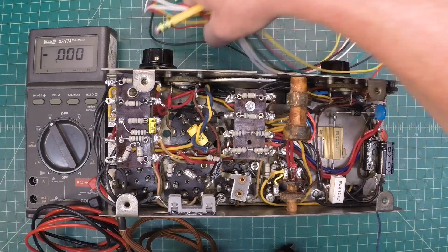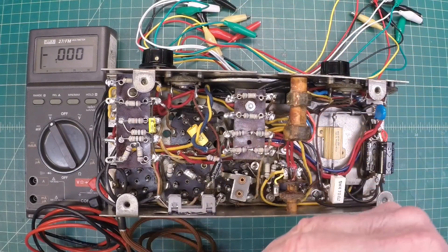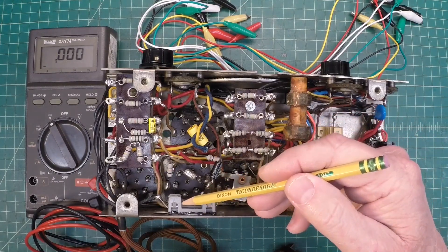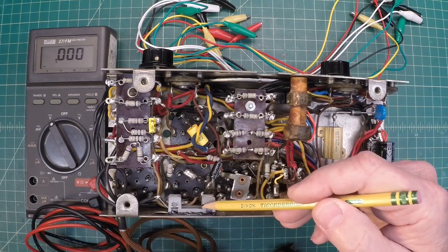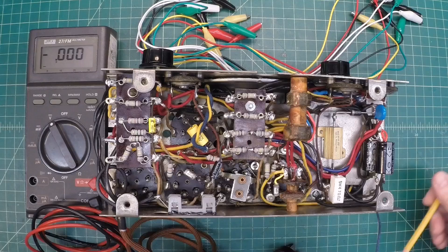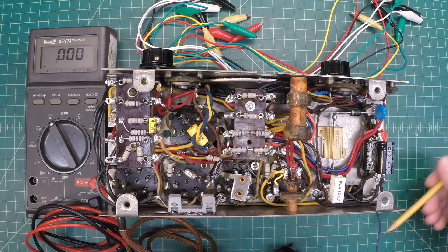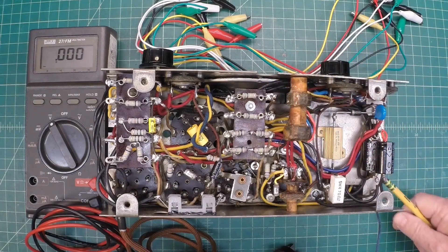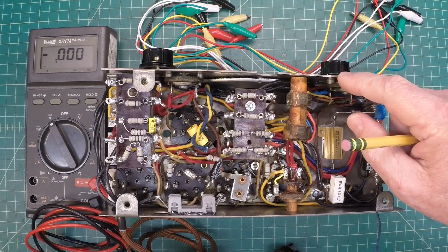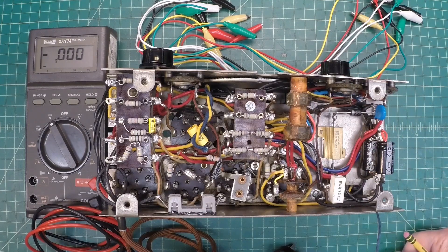You'll see I've got some jumpers laid out here. I'll get those hooked up along with this meter and an additional meter. I've pulled the fuse out. I'll probably put a couple jumpers across here so we can look at the current consumption of the radio. We'll look at the B+ voltage and we'll just listen for audio out of the speaker. Should be simple and easy. Let me go ahead and get things configured — we'll come back and flip on the Variac and bring this thing up for the first time.